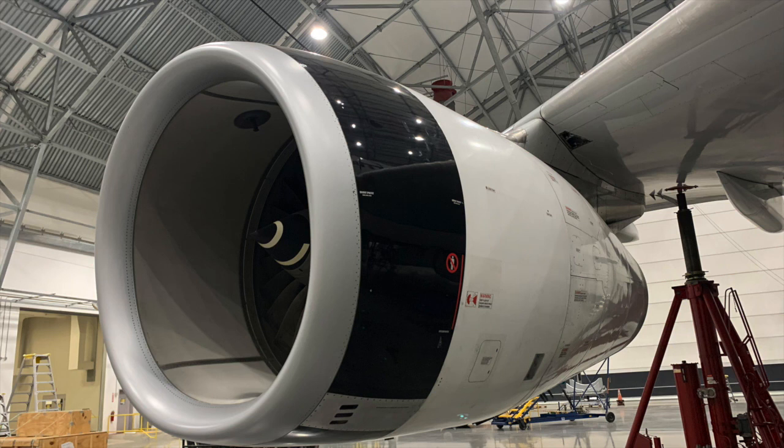Air turbine starters are generally designed so that reduction gear distress or damage may be detected by inspection of a magnetic chip detector. Air flow to the pneumatic starter from a ground unit is normally prevented from causing starter overspeed during engine start by activation of a flyweight cutout switch. A safety feature usually employed in pneumatic starters, used if the clutch does not release from the engine drive at the proper time during start, is the drive shaft shear point.